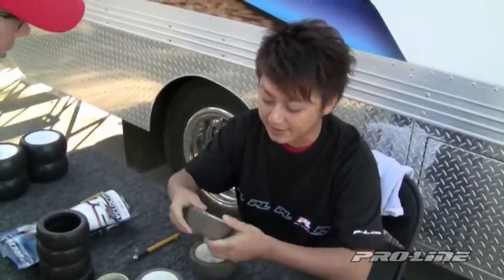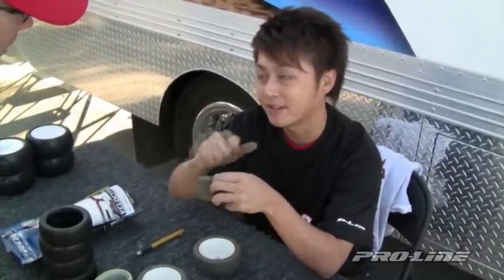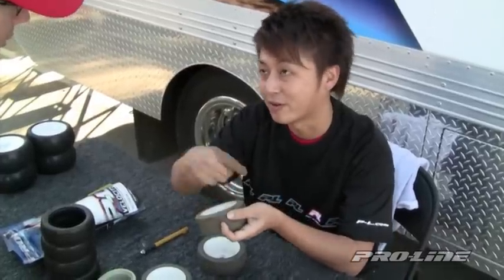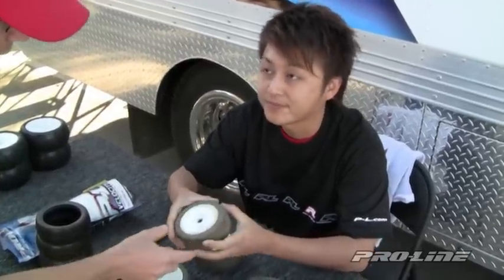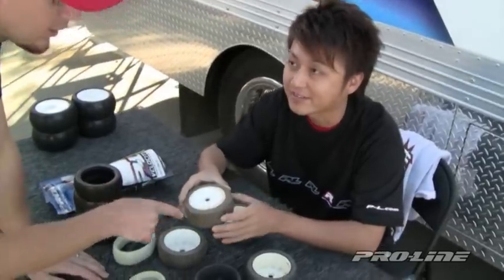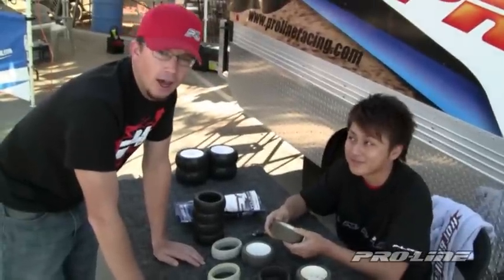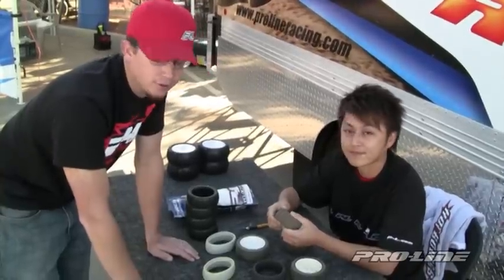It's okay, but if you cut too much — too thin — sometimes it comes off easily. So just try to cut close to the wheel every time. Even the second time, try to cut at the same spot. So, two times on the back and two times on the front — meaning you can change your inserts about four times. Plus the first set that was already in there, so about five times total you can change your inserts back and forth.